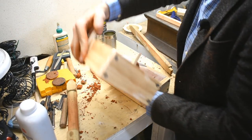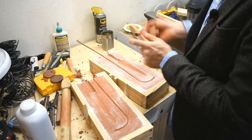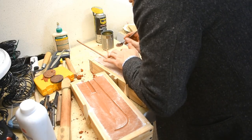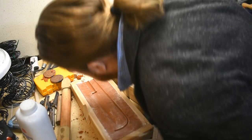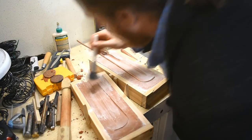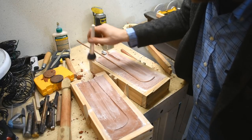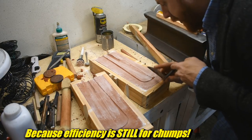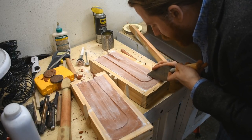Let's see if that turned out. Oh, it certainly looks fine. This transition here I'm slightly worried about — there's a little minor step from this to that. I suppose I could fix that with this spoon, because you want a smooth transition. I think — though I've never actually done this, so I want to refrain from saying you definitely want this or definitely don't want that. Quite sure you do not want loose sand in anything, which is why I'm brushing it with a very gentle brush. I realized I did that before I even cut the gates or widened the channel. Doing it like this is going to ruin the tip a bit, especially on one side, but I'll deal with it.